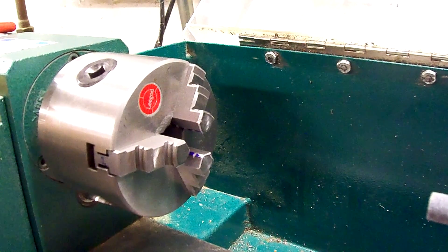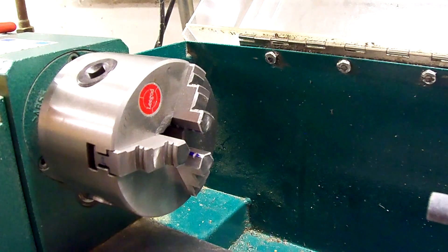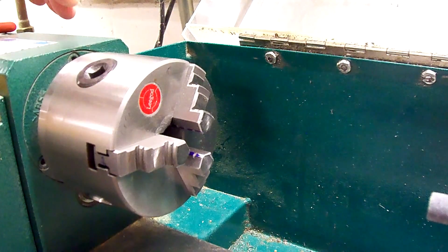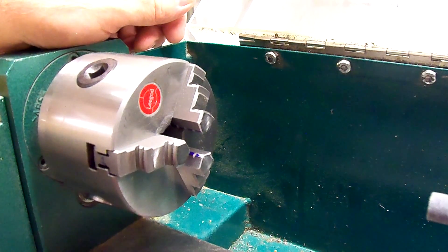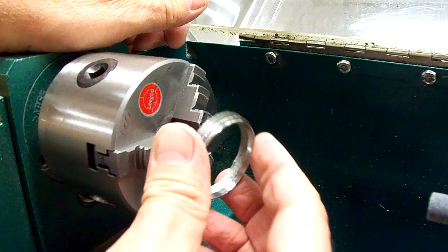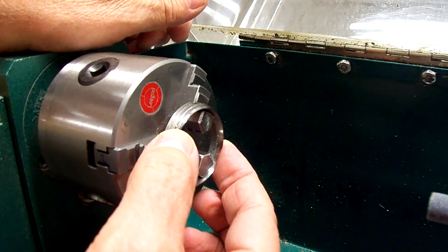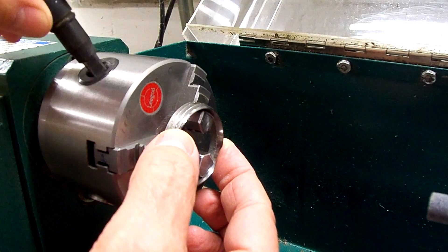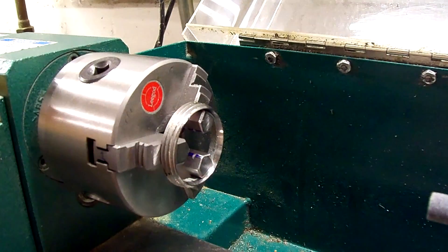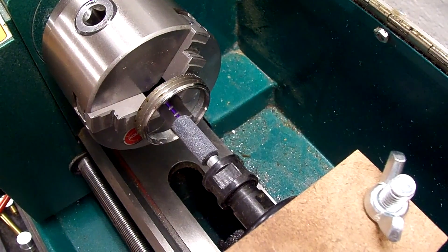By using that stone size, I can't use the plastic ring to put tension on the jaws like I was planning. So I went and got an inch-and-a-quarter pipe nipple and cut a piece off to use as a ring, because the inch-and-a-quarter inside diameter is about one and three-eighths. Hopefully that'll work — we'll tighten that up, just snug it, and see how it goes. All right, we're all set up.